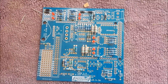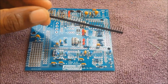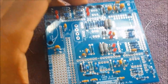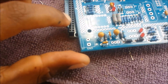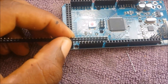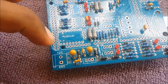All capacitors are sorted. Next step we're going to be installing the pin headers. The trick for this is — the board goes on the Arduino with the pin headers going through the Arduino and then through the board. You break the pin headers, put them in every slot including the back, then fit the board through the pin headers and solder at the top.